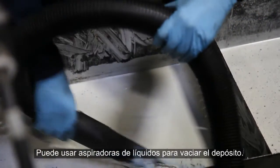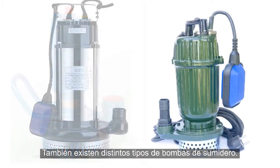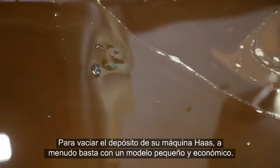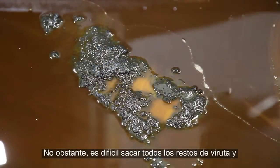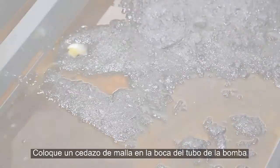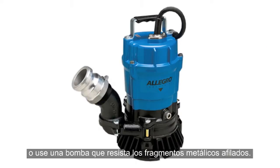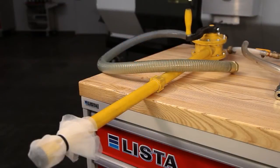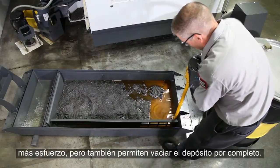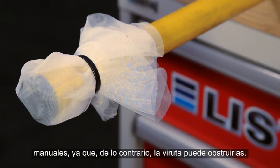Some wet and dry vacs can be used to pump water out of a coolant tank. Also, a wide variety of sump pumps exist. Even inexpensive smaller units can often be used to drain the tank of your Haas machine. But it's usually difficult to remove all the chip particles and sludge from the coolant before it's pumped out. So make sure the pump you're using either has a filter screen at the inlet, or that the pump is rated to handle sharp metal fragments. Manual pumps can also be used. They are slower and take some effort, but do a good job of emptying everything in the tank. You'll probably need a screen or filter for manual pumps too, since they will get clogged by chips.